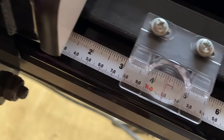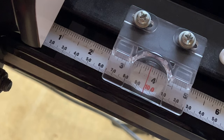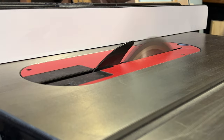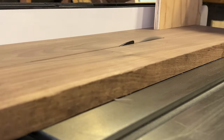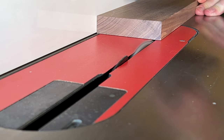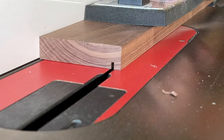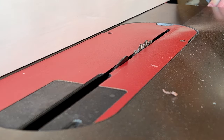Ripping it down the middle would allow me to get two long pieces and essentially all four sides of the shadow box out of that one piece of walnut — saving a little money on material. This piece is a little over seven inches, about seven and a half inches. Because of the depth of the waveform on top of the plywood, I figured about three and a half inches was going to be perfect. That gives me plenty of space for a gap between the front of the waveform, as well as this half-inch lip for the front of the frame, which is what you see me ripping here.